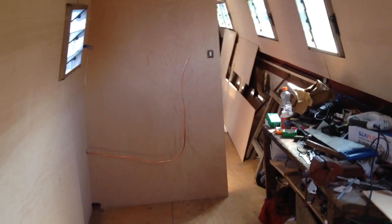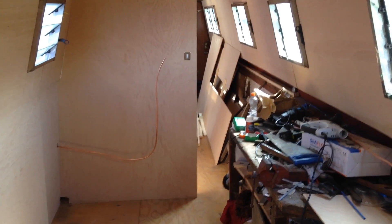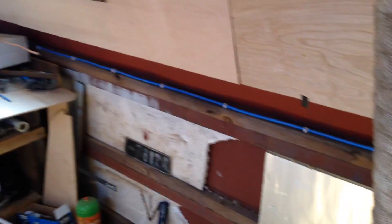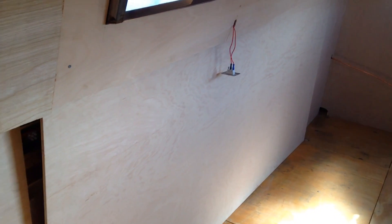It's worth mentioning that when you change the configuration of your boat — particularly with older boats — there are fittings left from the previous fit-out that need to be dealt with. I watch lots of YouTube videos about boat safety, and something like an old sink outlet: if you just box over it, it's a potential to let water in and sink the boat, especially if it's close to the waterline. So that's all been blanked off — I had to buy a blank and an inch-and-a-quarter tap off eBay to run the threads out so I could get the blanks in.